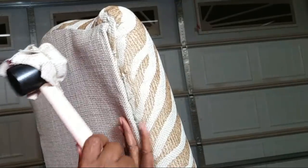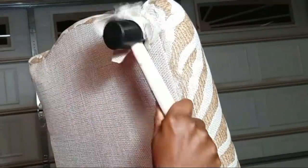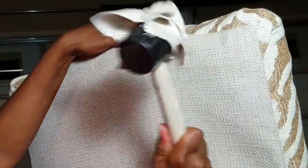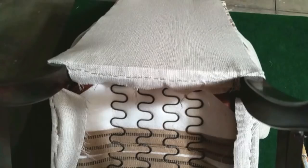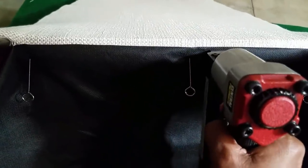This is another pioneer moment for me. You basically insert the metal tack strip underneath the fabric — my measurement guide was basically the edge of the chair — then turn that metal tack strip under and use your mallet and gently hammer it down. I was really impressed with how well this came out. Be careful that when you're pushing those tacks through the fabric you don't push one of them into your finger. Work from side to side as you move gradually down the back of the chair, stretching the fabric directly across. I have a fabric on the tip of my mallet to make sure I don't apply any black rubber on the back of the chair.